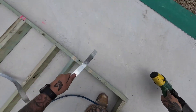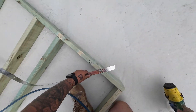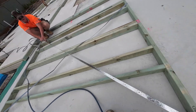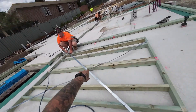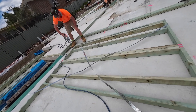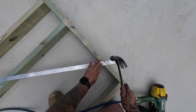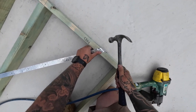The bottom of the strap bracing is completely nailed off as you can't get to the bottom plate later on once all the frames are stood and fastened down to the slab. But the tops are left loose because you don't actually tension up and make these frames square when they're lying down. You wait until they're all stood up and connected together to then go ahead and brace and plumb all your walls. That's why the tops are left loose in this video. The actual bracing of these walls doesn't happen until all your walls are stood and connected together — this is just purely to hold it there until we get to that stage.